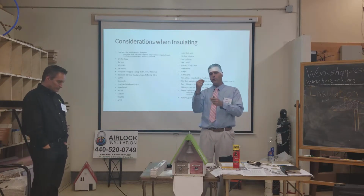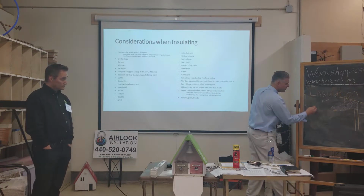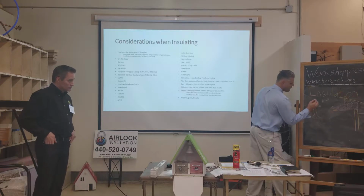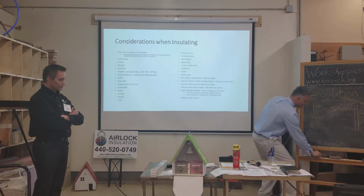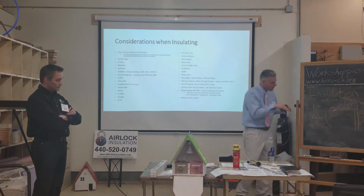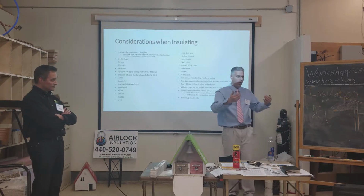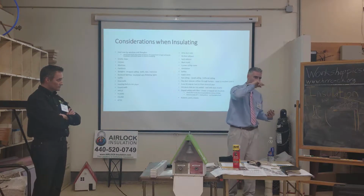And then I take a really thin tool called a dovetailed nail puller. It has a cat's paw on one end, and as it comes down, it flares out. This area is tapered and kind of hooked. Once the trim tool pops the trim loose a little bit, you can take this tool and roll the trim off the wall, working it along until the trim completely comes off, and then cut all those nails off with a pair of cutters.